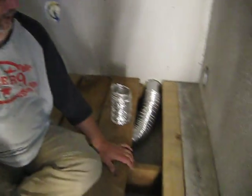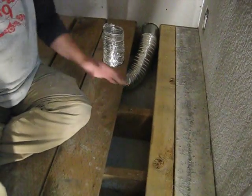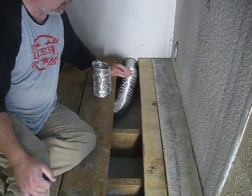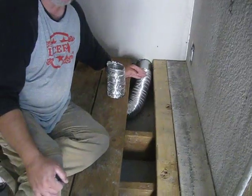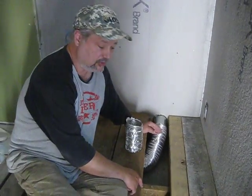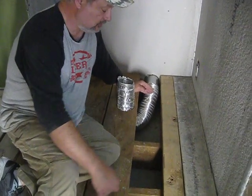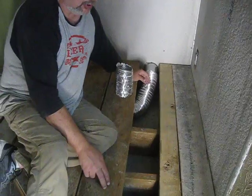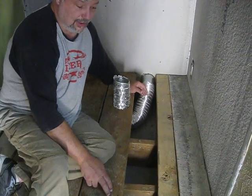I've got to cut another board for this, but I'm going to notch it about this far, so that it's like half of a 2x6 dimension. Like, well, actually, I'm going to turn it into a 3/4 by 6 right here, and then it'll be 2x6 this way. And then block this in, and then we're going to put some hardy board on this deck.